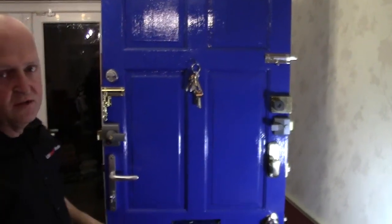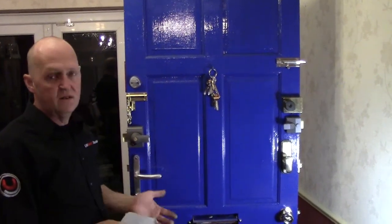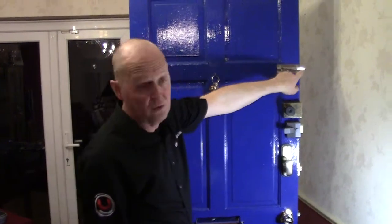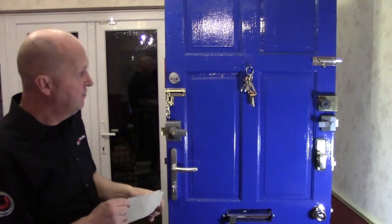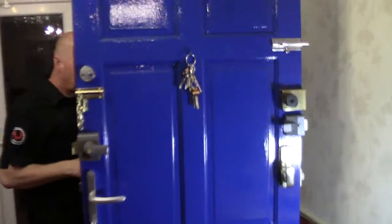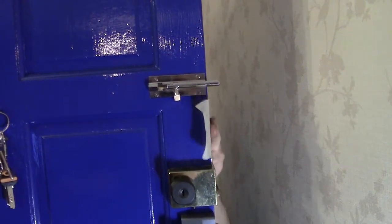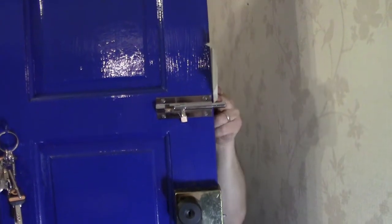Now I'm going to show you what we can do with the actual camera and the torch to view through the side of the door to see what other locking attachments are on the door. If you've undone the other locks but the door still doesn't open, there may be some bolts. With a piece of plastic mica, you find and locate the bolts, go to the other side of the door, simulate on the bolt, put the mica around the door, come round, slide it up and slide it down to find out where the bolt would be located.